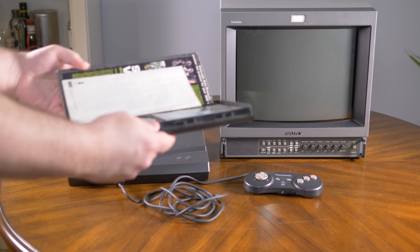A great bonus is this mod doesn't require any plastic cutting at all. Simply remove the RF jack and install the board that houses the input DIN and resolution switch in its place for a perfectly clean install.